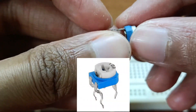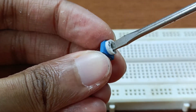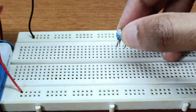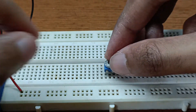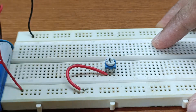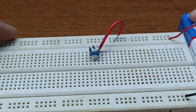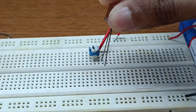So to build this circuit, you require a 1K potentiometer, which has 3 pins, and we will use a screwdriver to increase or decrease the brightness on the potentiometer. Place the 1K potentiometer on the breadboard. Now you need to connect the anode, which is the positive side of the LED, to the middle or the center pin of the 1K potentiometer.